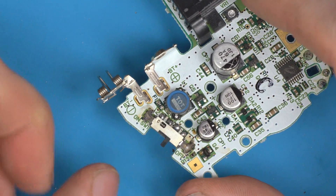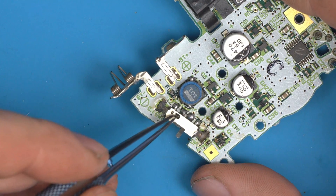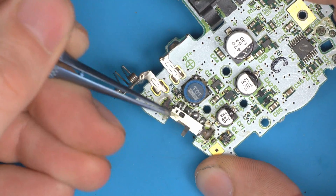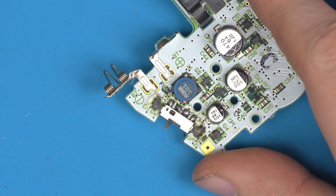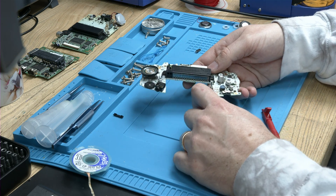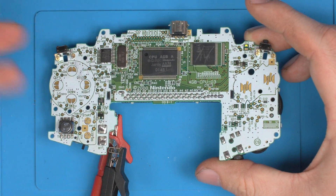For those who know this is a DS Lite switch, you'll note that when you move the switch it springs back — that's the issue. Simple solution: get a pair of tweezers, go inside, hook under the spring, and just pull up. The little spring is removed. Now look what we have — an absolutely perfectly sized and positioned power switch. When you put this in your console it works absolutely perfectly. Quick test shows the power switch works every time, as it will with this being a brand new switch.